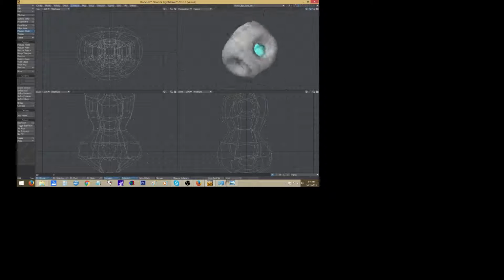Now you want at least a 1mm wall. I prefer 1.2 to 1.5. 2mm would actually be really preferable, but 3D printing is volume based. How much material is used is a lot of the cost. So I aim around 1.2, and that hopefully to really range around 1 to 1.5.